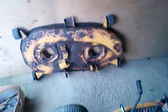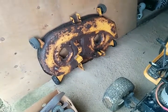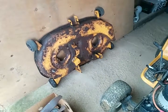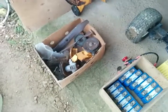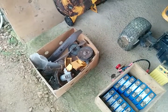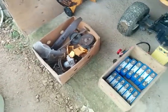The deck's in a bit worse condition. I took it all apart and removed all the pulleys, bearings, wheels and everything off it when we first did the project, just to rust-kill it, chip all the rust off, and paint it. I gave it a rust conversion paint job, but that was 18 months ago, and now the surface rust has started to come back again. So that needs doing again, and reassembly as well, of course. I'll probably need some help from Duncan — just looking at his Cub Cadet to see how everything fits back together again. It's got the two pulleys and all the mounting brackets and the two blades.